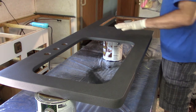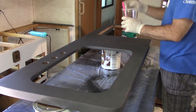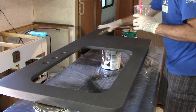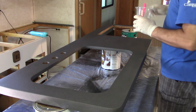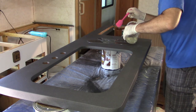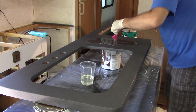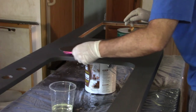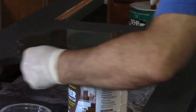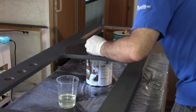Now we're working on the kitchen countertop and we're working inside the RV. I've already mixed up in the two three-minute intervals — you've already seen it. I'm going to start here on the biggest section. I've leveled it off because I don't want it leaning too heavily in any one direction. I used up all the remaining product and hopefully that's going to be enough. My mixing stick is the same thing I use for the spreader. Put it on and move on — that's one of my mottos, and a good one for painting or anything like this. It helps us avoid excessive manipulation of the material.